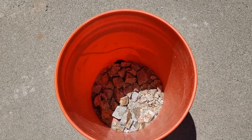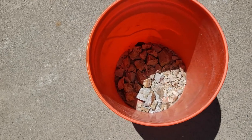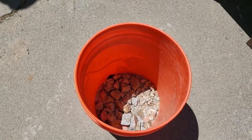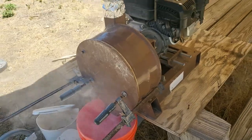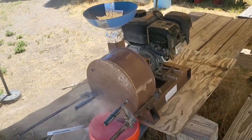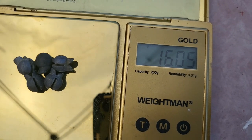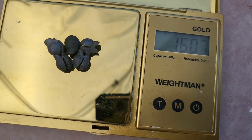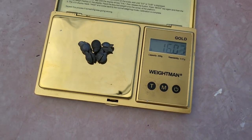Alright, 3.4 pounds crushed up. We're going to run it through the K&M chain crusher and turn it into absolute flour, then we'll smelt it up. This is going to be a real easy recipe: we're putting in 16 grams of lead, 100 grams of material, and 200 grams of Mahoney Mine flux. Let's see what we get.